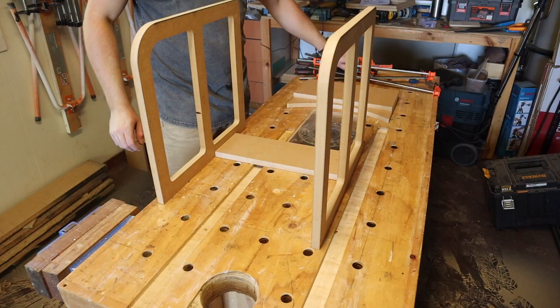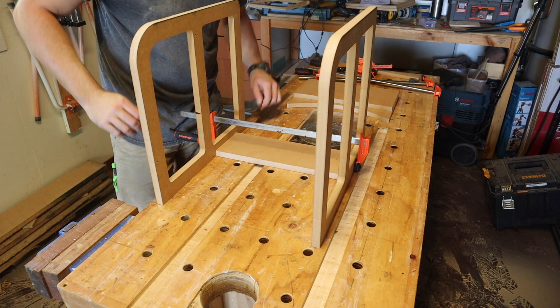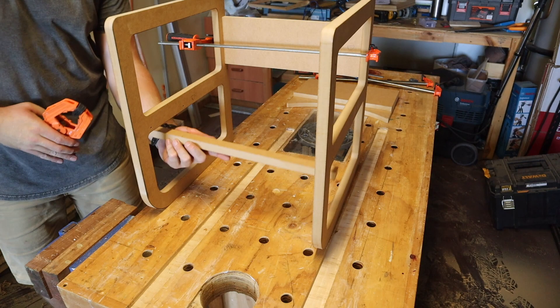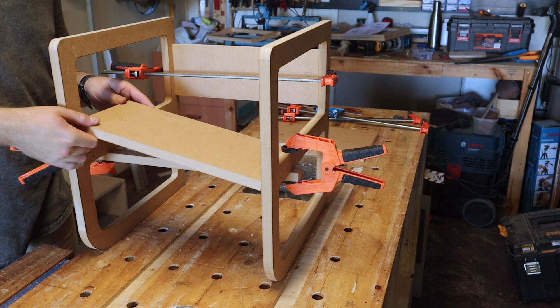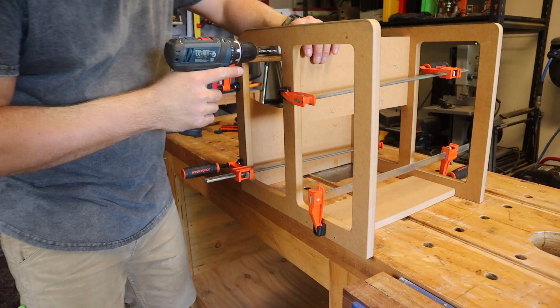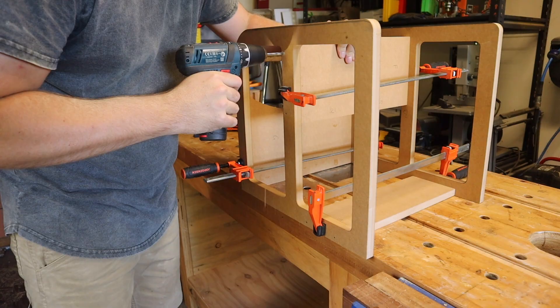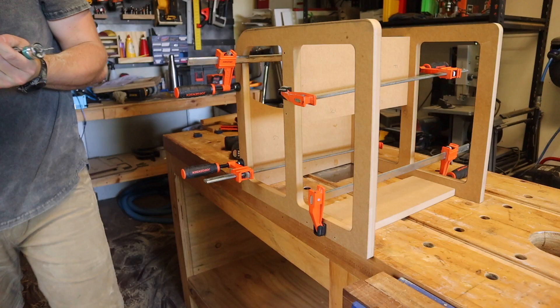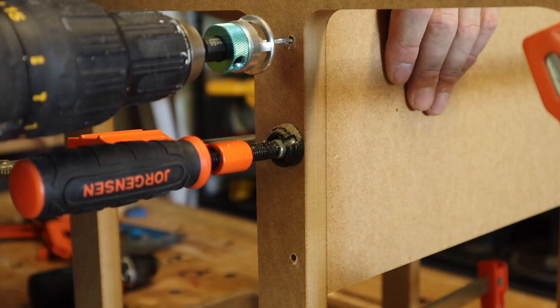Now I'm going to have a quick dry fit with some assistance from clamps. Following the plans, I make sure each piece is set out appropriately. The seat has to sit flush with the edge, so I clamp a bit of scrap to rest it on whilst I clamp it in place — this will have to do until I get more hands or an assistant. Whilst everything is clamped together, I take this opportunity to drill pilot holes for the screws. Being a super duper primo professional woodworker, all of these pilot holes are countersunk. There are a fair few screws in this thing.